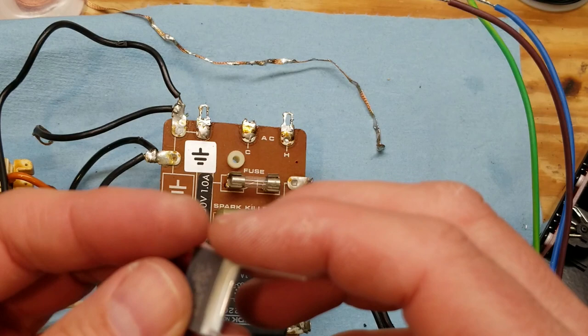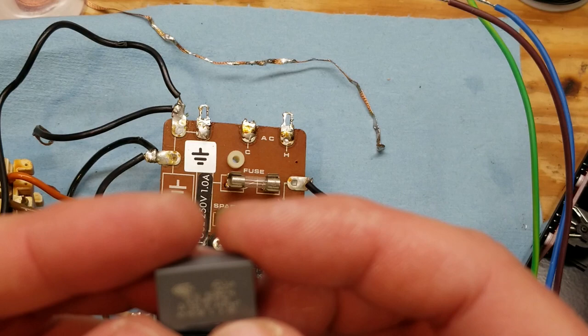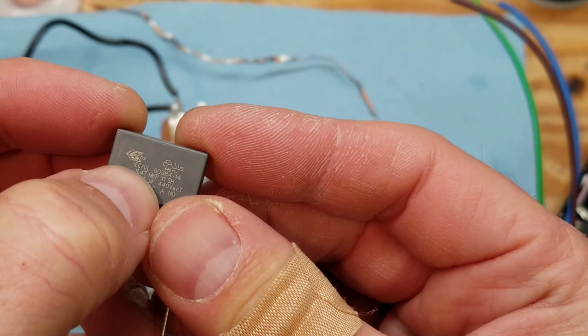One thing you do have to know about these polypropylene capacitors is they cannot tolerate much heat. Turn the soldering iron down to about 400 degrees, and you have to do this really quickly — only maybe five seconds. They are polypropylene inside, encapsulated in fireproof resin. So if they absorb a spark and break down internally, unlike some capacitors that will explode and spew fire, this one will not, because it's intended to be a safety capacitor. You want to look for a UL — Underwriters Laboratory — mark on it.